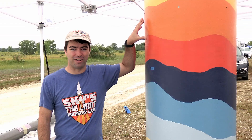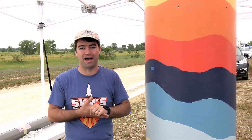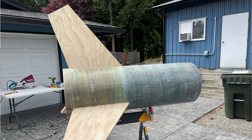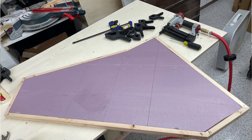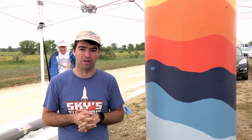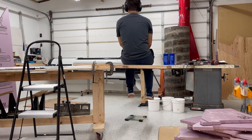It needs an O motor for that and we couldn't fly an O this year out at Bong. The bottom section of the nose cone is about 4 feet long and that will have the 28 foot parachute, the electronics, and everything else going on inside. The fins are 10 pounds each, which is quite light given their size. It's a foam core — a one inch pink foam core — edged with an inch of wood, and the surface on each side is quarter inch plywood. So they're super sturdy, really nice and strong. I can sit on them all day long.